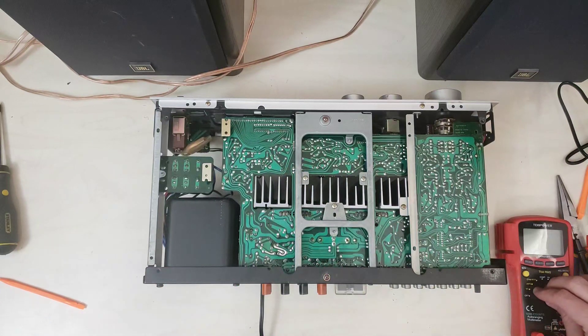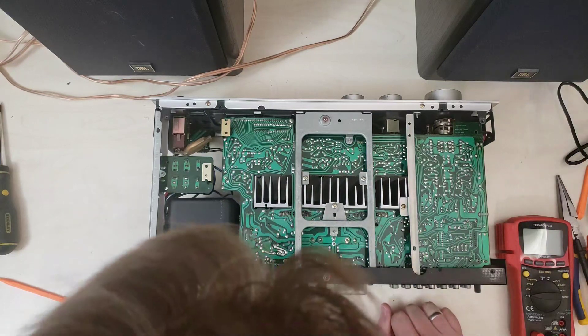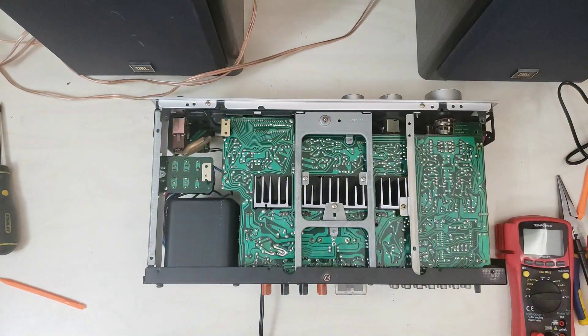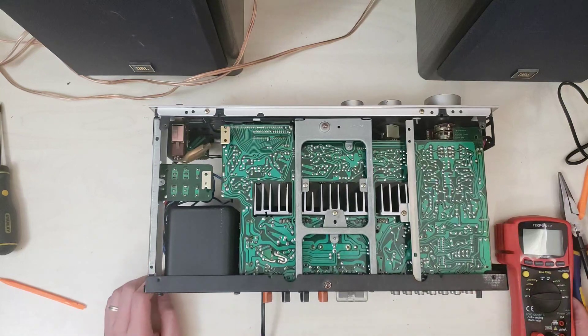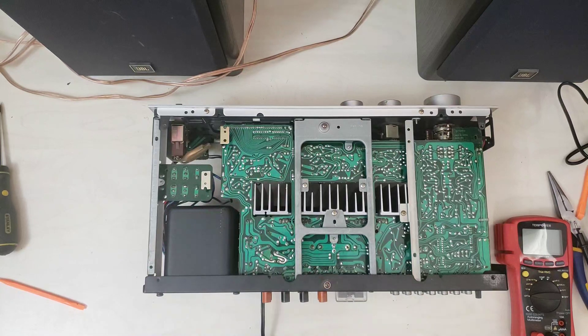The best path here is going to be to take this side out. I'm trying to decide if I want to go through the whole rigmarole of taking the heatsink out and taking out both of the packs at the same time. Actually, I kind of like my trick with the angled driver and the needle-nose pliers. I'm going to go ahead and desolder and start the process of taking this bad pack out — remove it and replace it with resistors like we had done before on the 44, and see if we can power on and check this thing out.